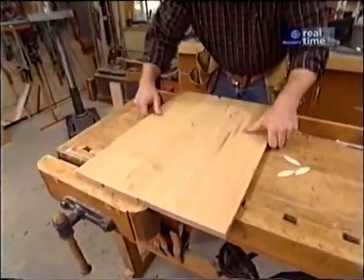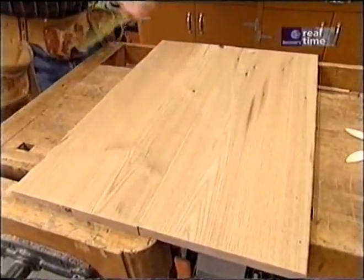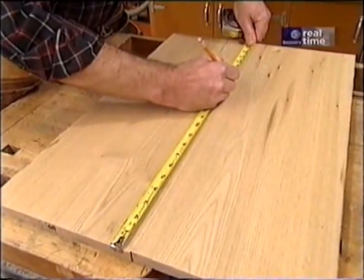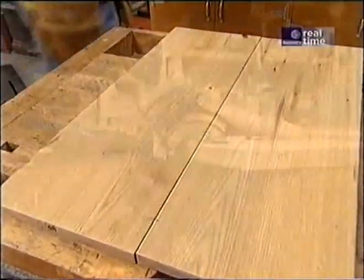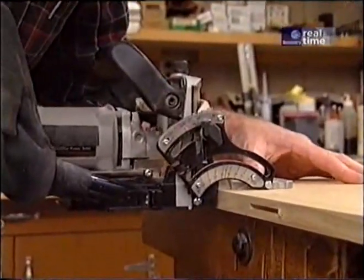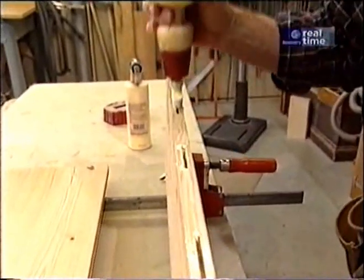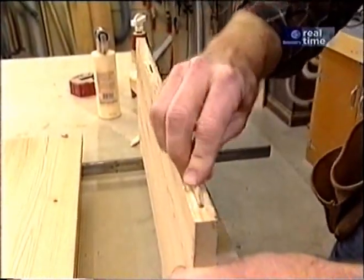Let's see how we did. That's nice and tight — the joint will be invisible. Now I need about 18 inches overall width for this desktop writing surface. And since I have a split here, I'm going to start from this end, go 18, back off two inches, lay out for a biscuit, two inches from this end, one in the middle. A little bit of glue on each edge of the joint and a little bit of glue in the biscuit slots. Put it all together and clamp it up.